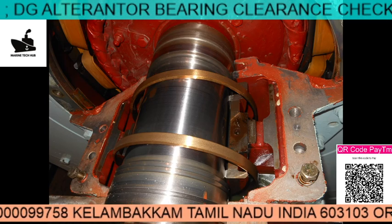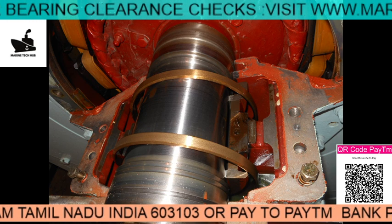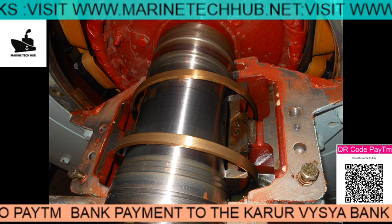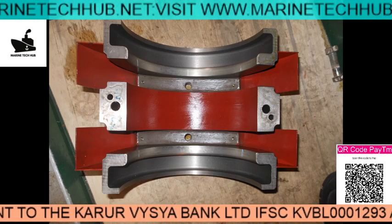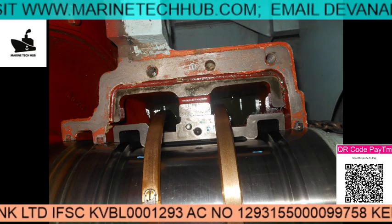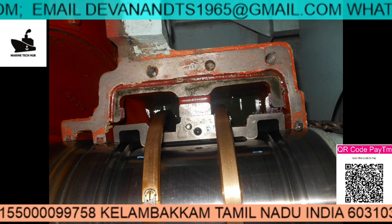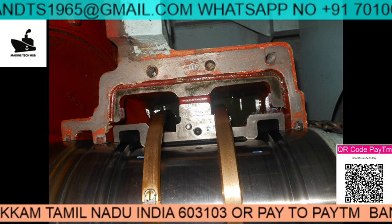This is the oil ring. When it is rotating, the oil gets splashed, so make sure the rings are in good condition — very important. This type of experience you will get only when you are in the dry dock and have an opportunity to look at it. You can see the top cover removed. You can see the oil ring and the oil inside. When it is rotating, this ring will rotate and splash oil such that lubrication takes place.